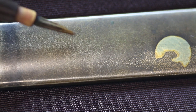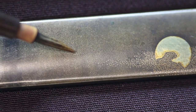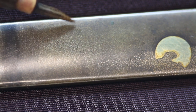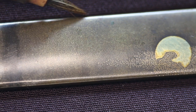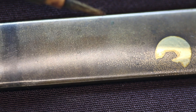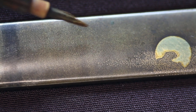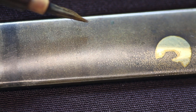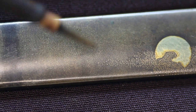Here's a little scratch, a little mark in the surface. These are the kind of things I have to consider carefully when restoring pieces like this. This is a very delicate piece — polishing that out would reveal fresh metal, which may patinate to a different tone than the rest of the surface. What's happened over the years is that the copper content of the shibuichi alloy has tarnished in one way, and the silver content in another, which is why we get various green, brown, and sometimes yellowish tones in the shibuichi — none of which were original to the piece, but are a consequence of age and further tarnishing.